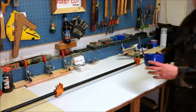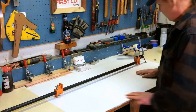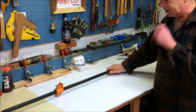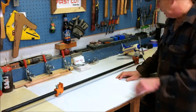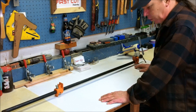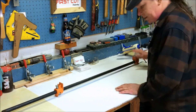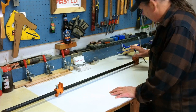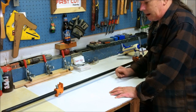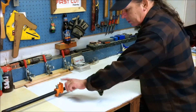Let's get a little serious for a moment. You all know what these are — it's a bar clamp. I can show you a tip my freshman shop teacher taught me. I was having a problem because I was trying to do a glue-up — I believe I was making a chessboard — and these end pieces, because they're made out of cast iron or steel, they kept denting the sides of the wood I was trying to clamp together. That's probably a combination of me clamping too tight and using a softer wood.